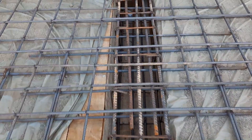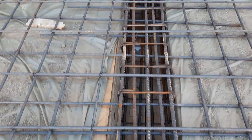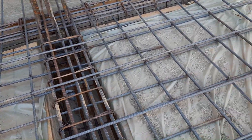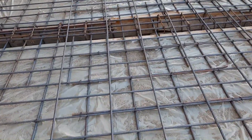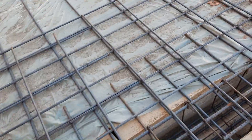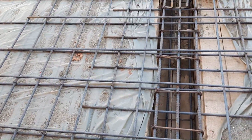Why did they do this? Because they did not follow the structural steel design. The main reason is the lack of structural design. Also, I don't see any development length at the end of the beam, which is very important. You can see lapping everywhere throughout this construction.